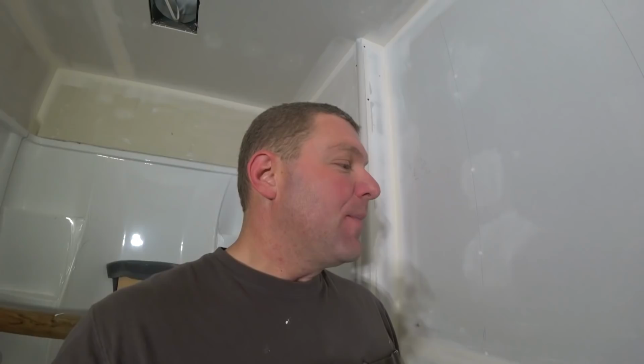And I'll admit it right now before I even start, this is also not my strength. There's some artistry to this stuff. It's the ability to kind of see the material and feel the knife and kind of make it all work. Let's see what we can do. I think the ultimate goal too is to use the least amount of mud possible. That makes for less sanding and also conserves resources, and it dries a lot quicker. I still have it in my mind that I might be able to get texture on here tonight. So let's see how bad this goes.